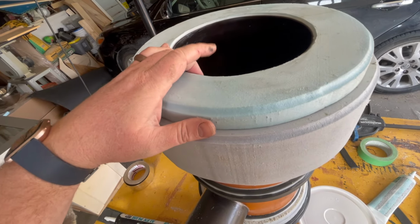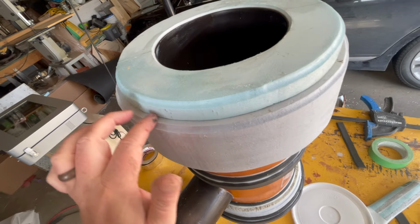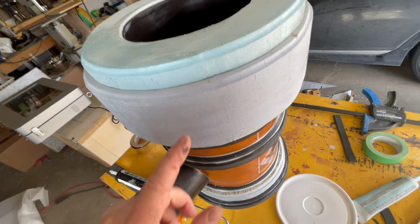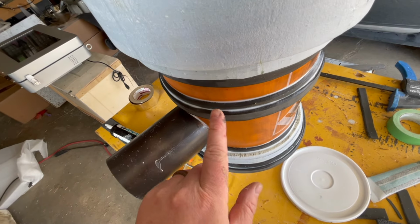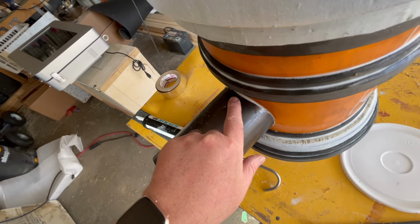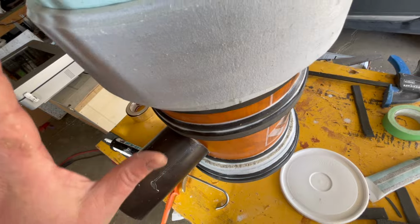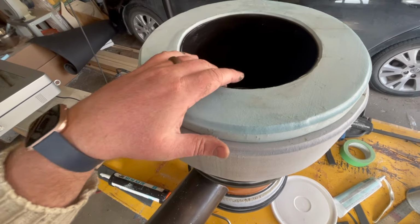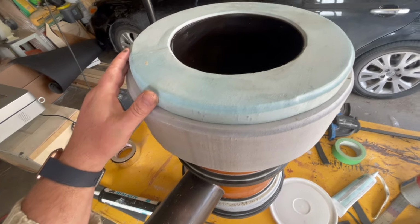So anyways, I'm going to use some glue on this, then I'm going to caulk all around every single gap, which you can see I've already done, which takes absolutely forever. And it's amazing how much you go through to get this all done. Same with here. This is all caulked in just to give it a beautifully smooth finish before we start getting to painting.